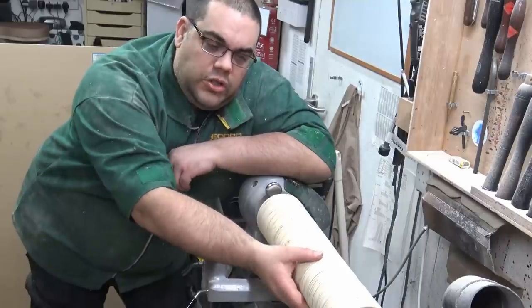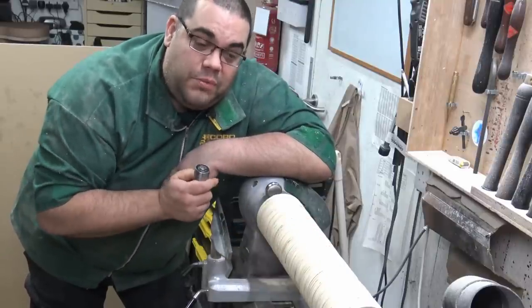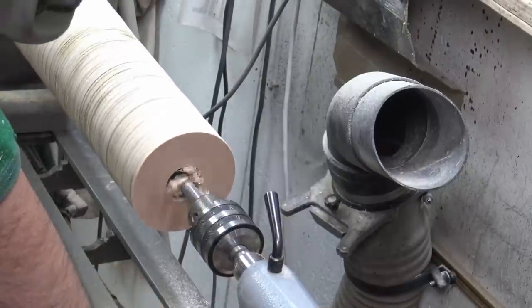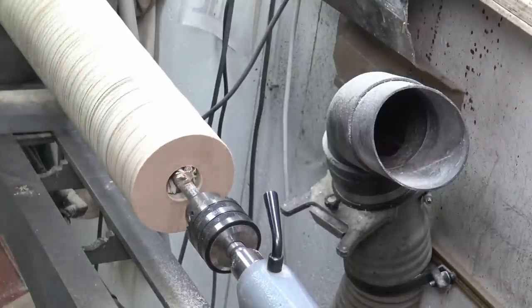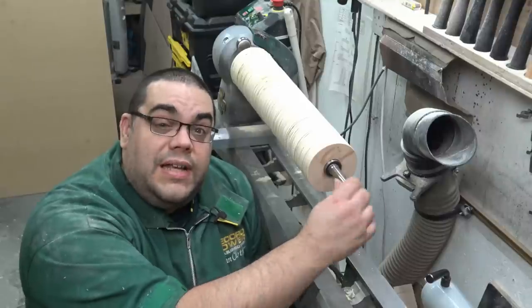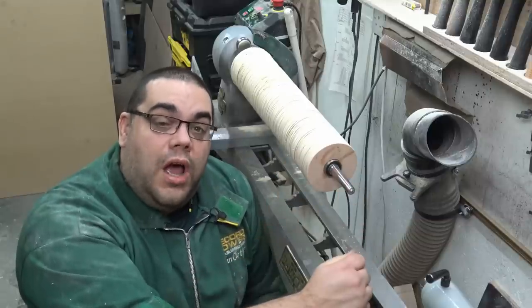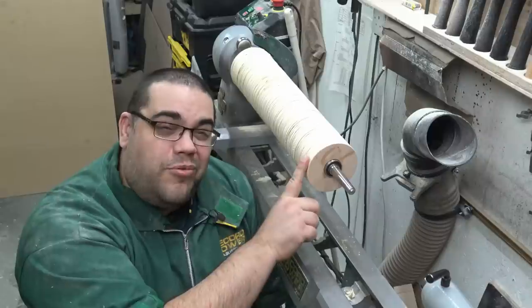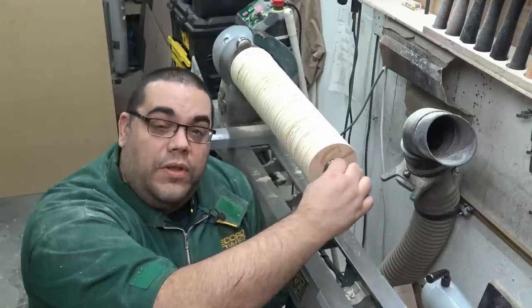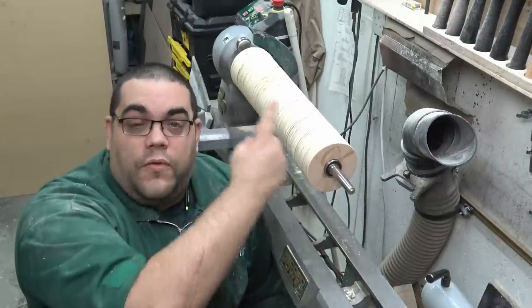I think this might move around too much, so I'm going to start and see how I get on. If it starts moving around too much it's just not going to work — it'll be too sloppy — and I'll have to look for another method, but let's give it a shot. So that's that installed. You may have noticed that I ran some super glue, some CA glue, around the inside of it first — it wasn't to glue this in, it can be removed. It was there to provide a bit of strength and soak into the wood, to help the bearings grip and provide strength from lateral movement.